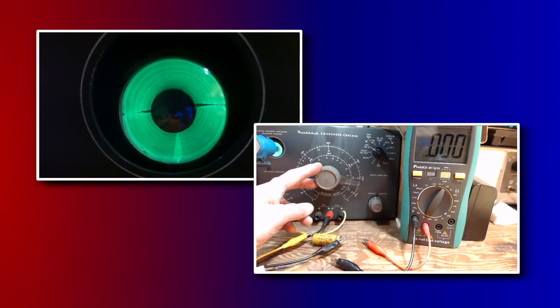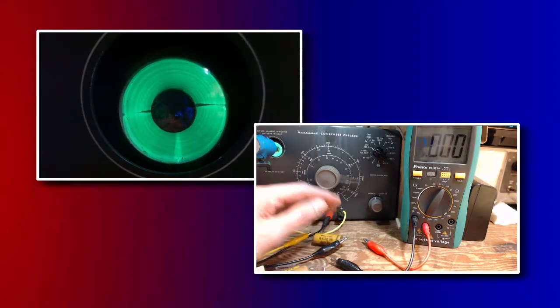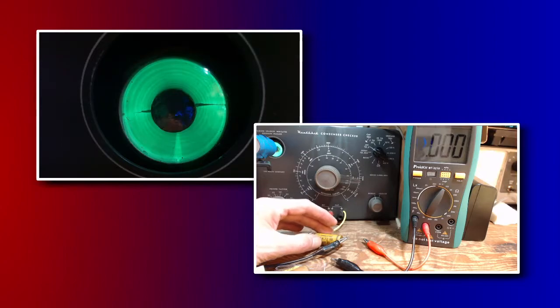Now those two things, you can't see it right now, but they're actually overlapping, and that's why you're getting the extra bright band at the bottom. So as I shrink the extra bright band, I'm in effect opening the gap. It just hasn't reached the point of passing the overlap. So that would be the reading, but pretty suspicious already. And on here, that would be 0.1, something like 0.15.